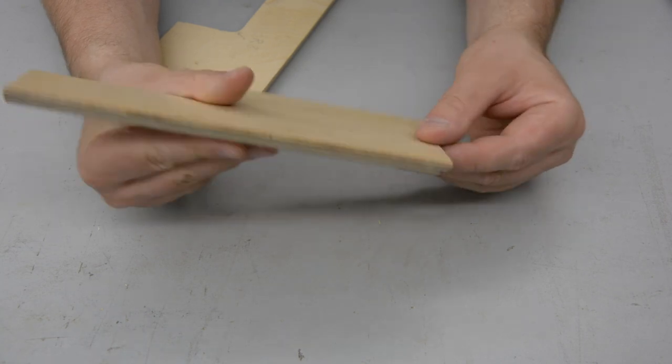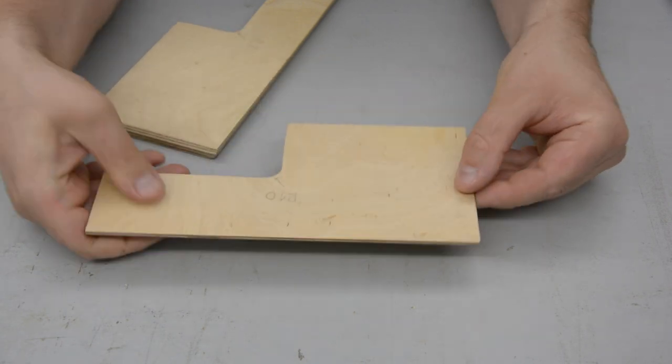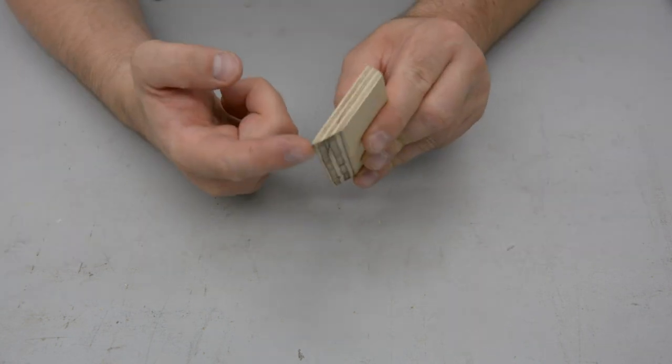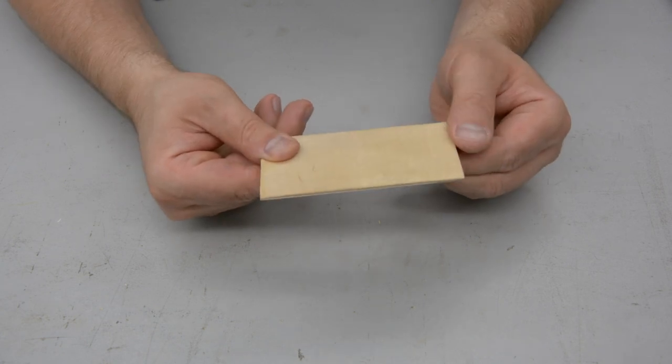I used the same 45 degree chamfer bit and sunk it around 6mm deep, leaving the 3mm 2-ply edge. The edge looks lighter, but still can be seen from a shallow angle, so I went a step further. And this looks much better, and that's what I will use.